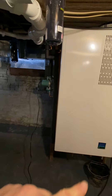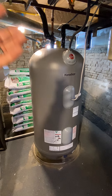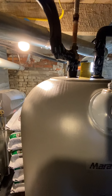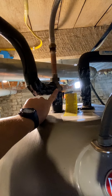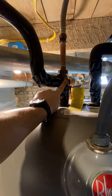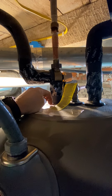All that water will be pumped slowly into this Marathon tank, which is also being fed by solar currently today. This is acting like a huge battery — it's storing all of that thermal energy. And this tank will get to a lot hotter than 120 degrees, which could scald you. However, here's a little party trick — there's a mixing valve right here. This is a thermostatic mixing valve.